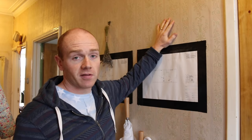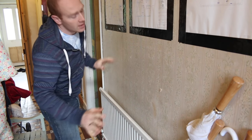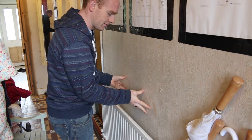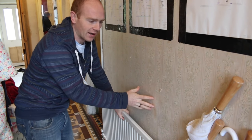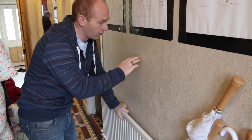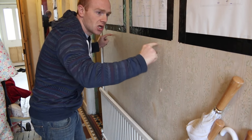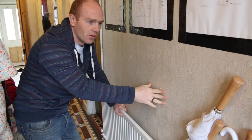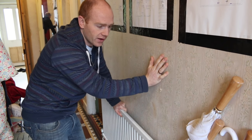Hopefully the plaster is going to be sound enough in most places that it can just be skimmed. This is a brick wall and it's still got the lime plaster on underneath, but up to a certain point a whole section of lime plaster has come off - there's about a good inch or so of movement where it's blown, probably due to the radiator drying it out and pulling it away from the brickwork. My idea is to cut a nice sharp line along there, lift it off, then either put a backing coat and skim it, or just put a sheet of plasterboard there given the time restraints.